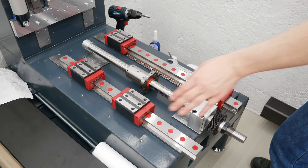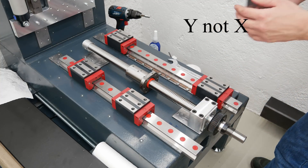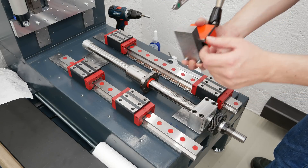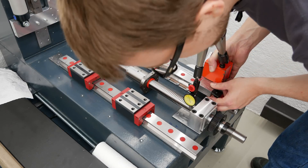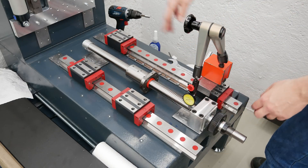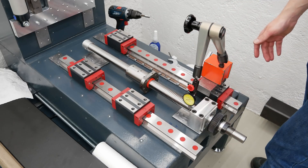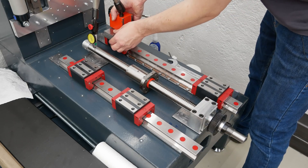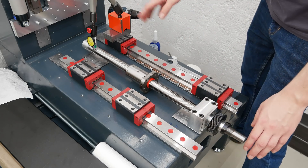Before I can mount the big plate here I have to mount the x ball screw. This time I'm pretty sure the method I showed in the last video — using this block which I can put on the carrier and probe the ball screw — will work fine here, because on the horizontal axis I don't have to hold it. I can switch back and forth very quickly and alignment should be very easy like that.